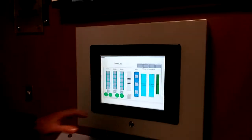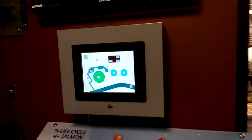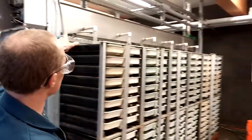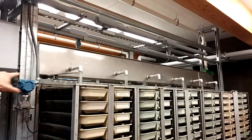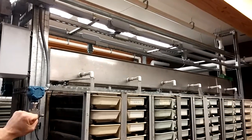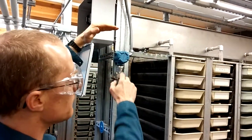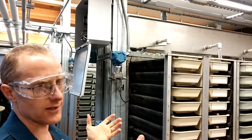So we'll take a look out there at how this works. We're looking at one of the water troughs here — the egg tray assemblies. That aluminum water trough is fed water from the north end. It flows down the trough and then flows out through its nozzles. We have the ability in our instrumentation to measure the height of water in that trough, and then based on the height of water and how far it is above the outlet point for each nozzle, we can calculate the flow rate coming out based on Torricelli's theorem.